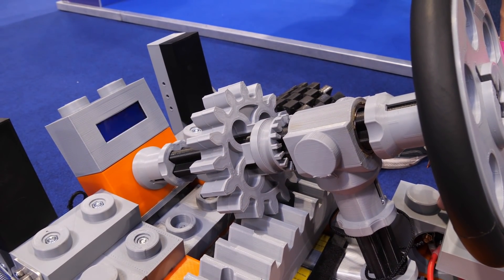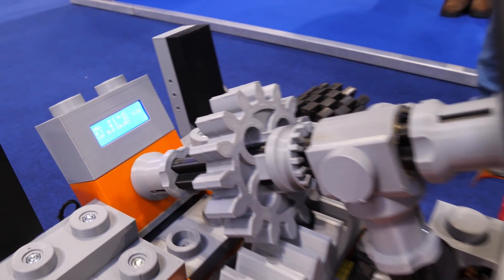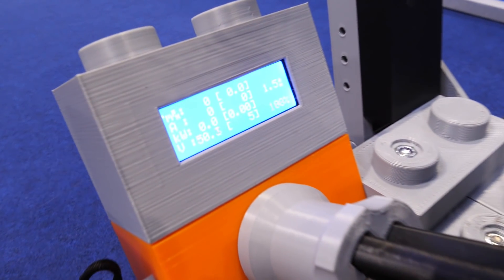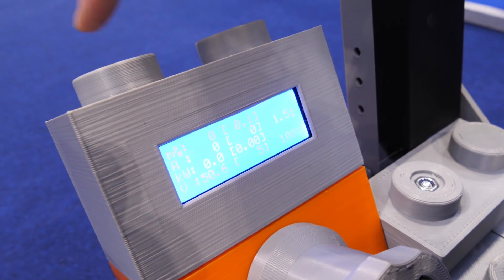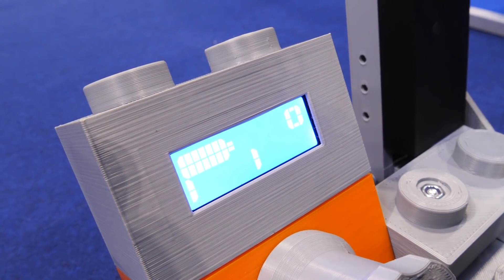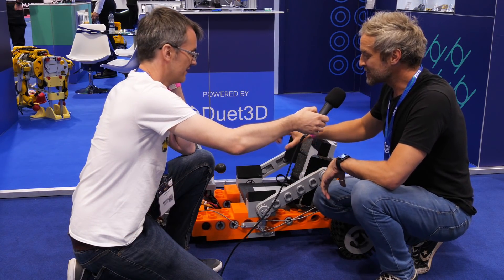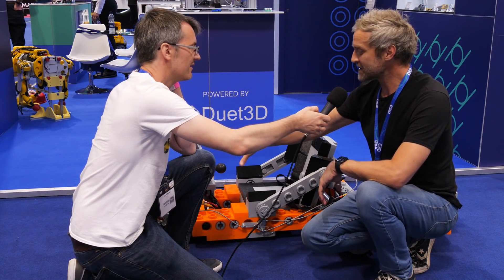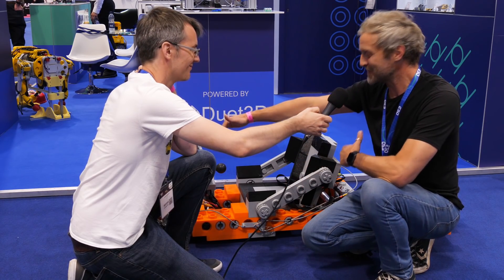The steering all looks like it's totally 3D printed out of plastic, and you've got pedals and actual disc brakes. The steering is a parallel linkage so it's not ideal but it does work now that I've got the differential in place, because before I had this differential it wouldn't go around a corner unless you skid steered it. The steering is working really nicely although it is a parallel link which is not too good, and the turning circle is horrible because now it's really long.